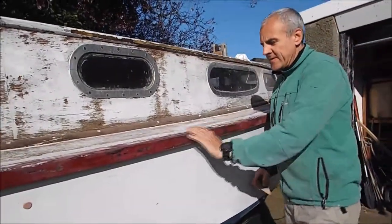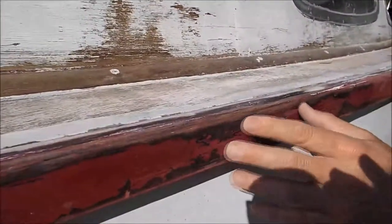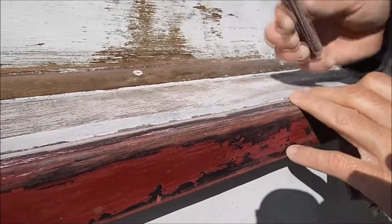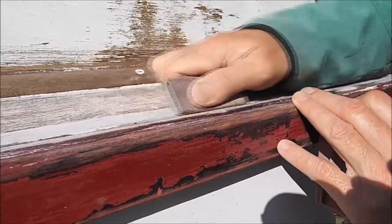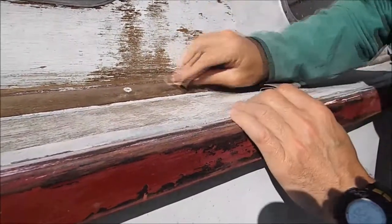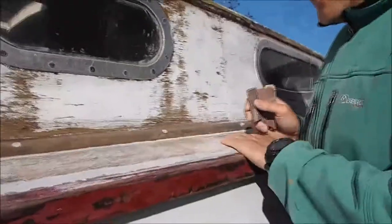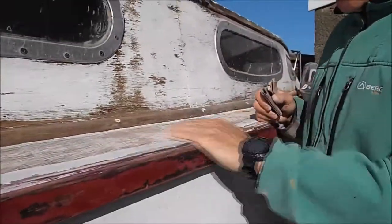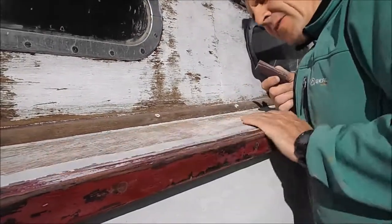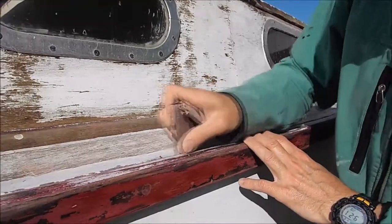If you come close up here, you can see all the timber here - look, you've got nice smooth timber, we've taken the shine off this and that's all we need to do. And then if we need to, we can just get down into this little groove here with a little bit of sandpaper, and similarly here we can just get in there with the sandpaper. You can see it's come out quite smooth there - that there is perfectly ready to take a coat of primer and a coat of paint. It's not going to be mirror-like, but it ain't going to be bad. Then I can finish off by sneaking down into the groove with a bit of sandpaper.